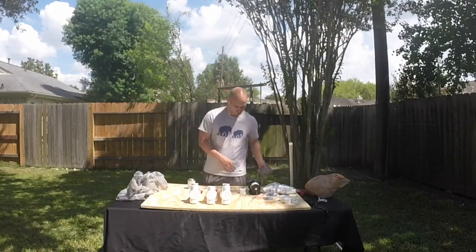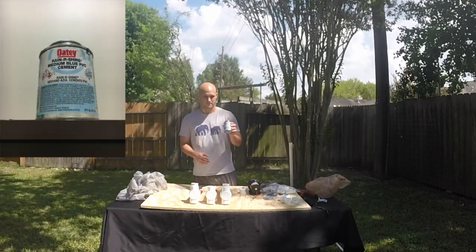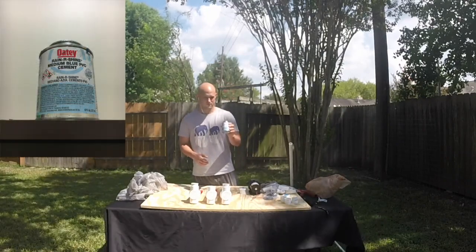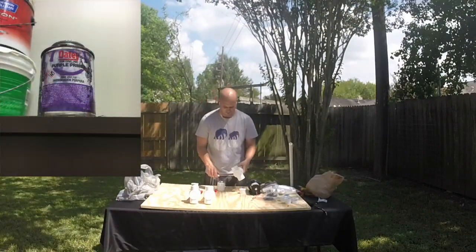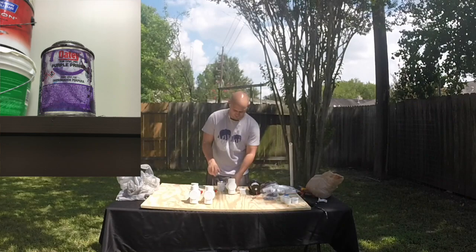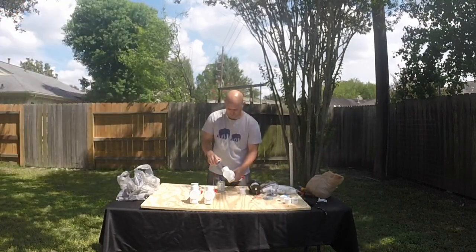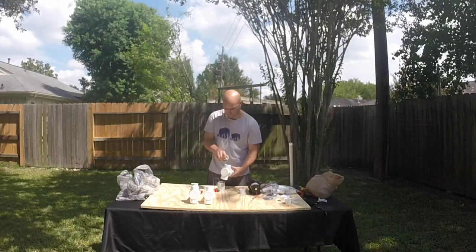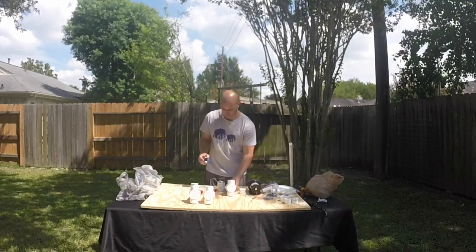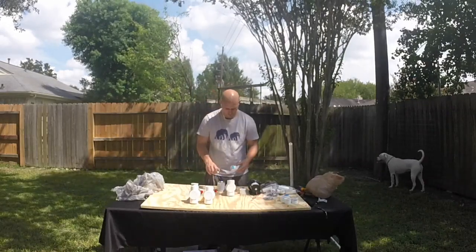Make sure to have a towel handy to remove excess glue. You'll also need PVC cement and PVC primer — the primer goes on first. Here's one of the mistakes that I made: I'm putting glue directly on without primer. Luckily, everything worked out for me, but you will want to put your purple primer on first, and then put your glue on and insert your reducers.